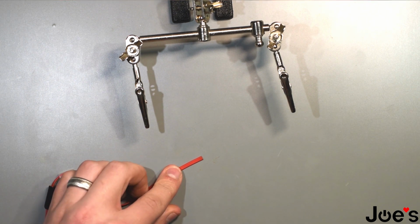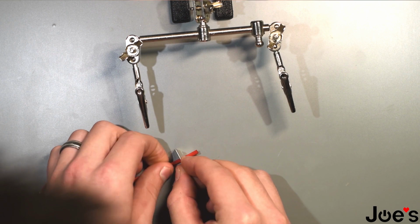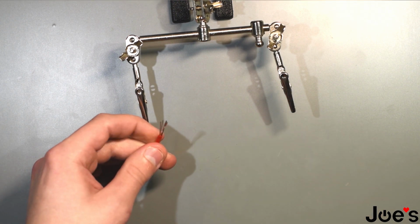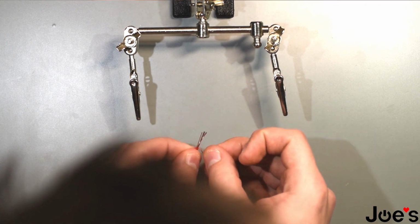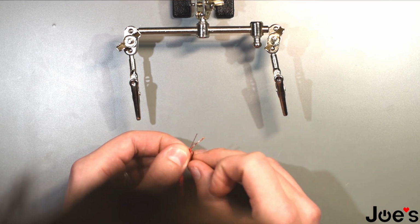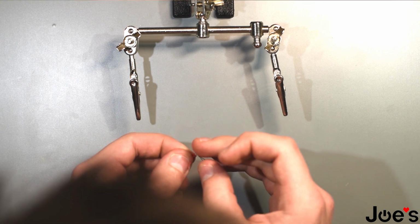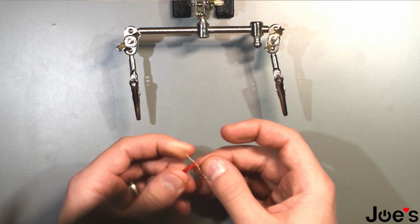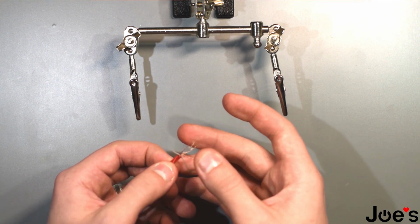You take a razor blade about half inch down, cut down so you can see the wires. Then you go ahead and separate all the wires. Take some time. And in this gold wire, there's this white wire, which is the mic wire, which lets you talk to other people for communication.